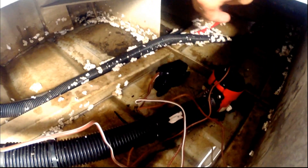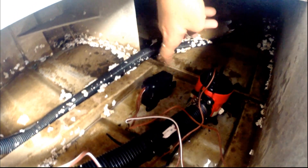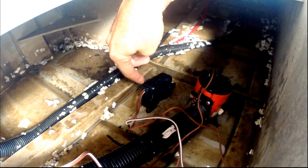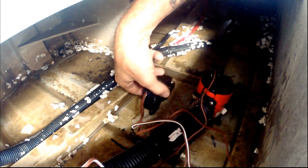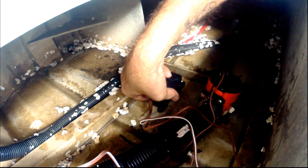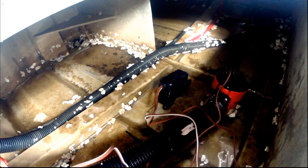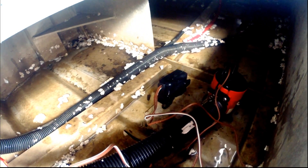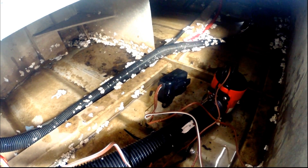So I've just got a little bit of cleaning up now, but this is the arrangement I've gone with. A little bit parallel, similar distance to the centre line of the boat. The float switch is just a little bit more outboard, just a bit higher up. Testing this one — as I said, you just put your fingers on the two connectors here. And it'll start up if you hold it, so it's testing if the float switch is working. And now it's switching off rather than the pump just sitting there pumping and pumping. So I'm just going to clean a bit of this foam up, tidy these wires, and we'll be good to go.